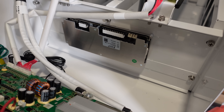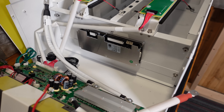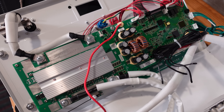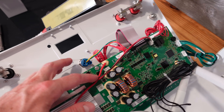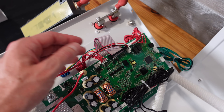I personally am not a fan of active balancers. They're great when you're commissioning the battery for the first time and will get it balanced quickly, but once your battery's balanced you should not need an active balancer. We have a few miscellaneous cables down here: main power for the BMS, communications to the Bluetooth module, power switch, and a few communications cables to the front display and communications ports.